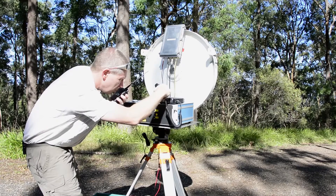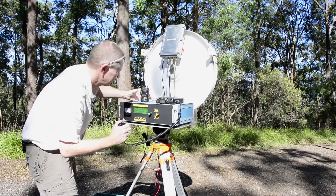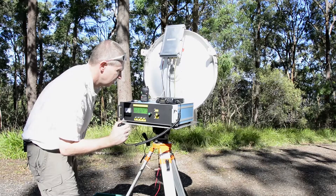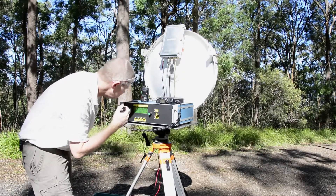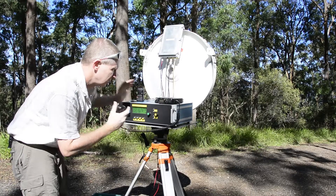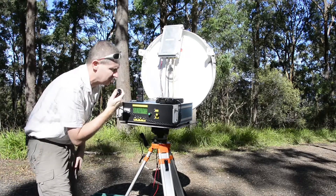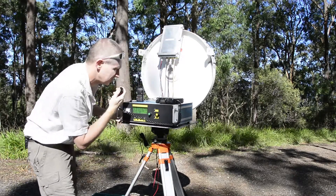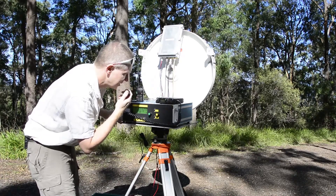Fumble fingers here — carrier coming. And the frequency's spot on too, by the way. VK4GHZ portable — you're full scale, Adam, I can't get you any louder. About the best I can get from you, Alan — it's about a strength 8, but that's a substantial improvement over last time where I could only just hear you. In hindsight, I don't have the LNA in the front end either, which I think I had last time, so it's not a direct apples-for-apples comparison, but with the LNA you'd only be stronger. Certainly a good test, and I think an improvement was made.